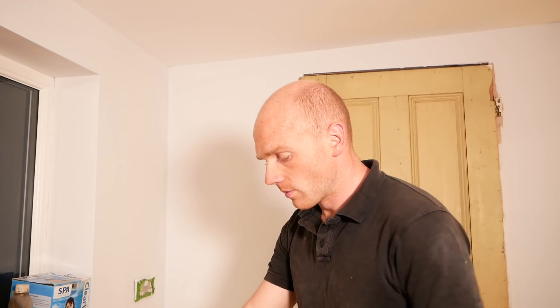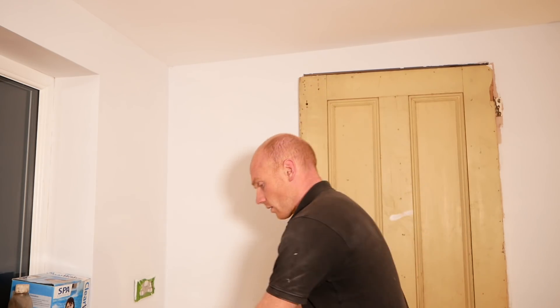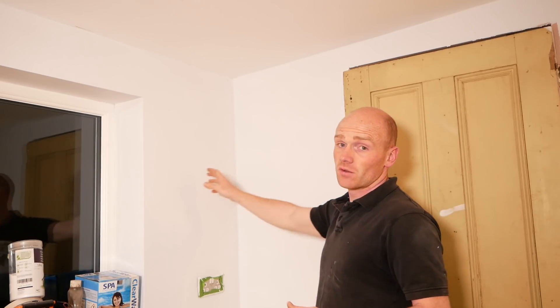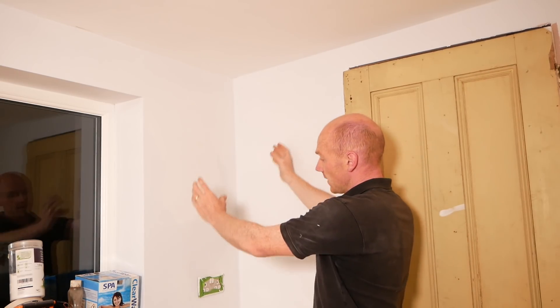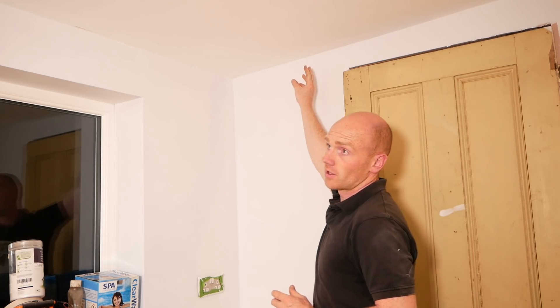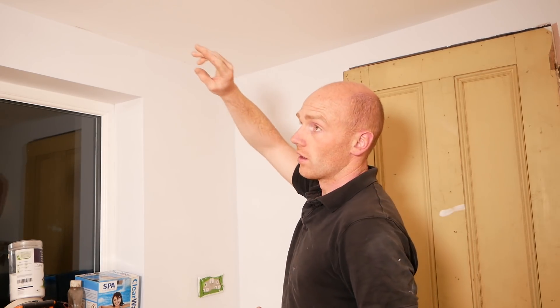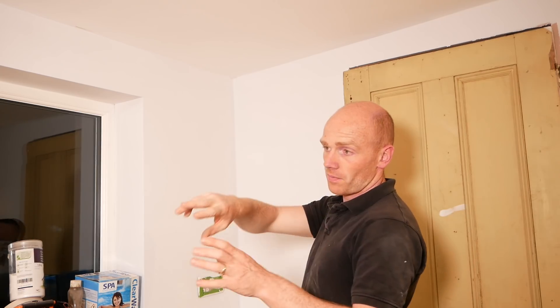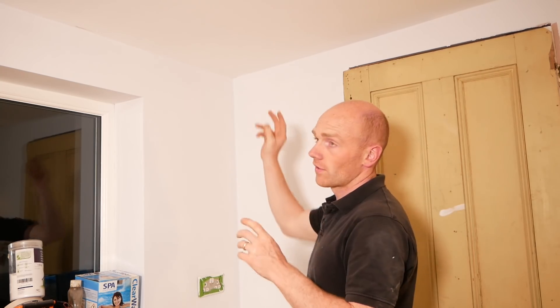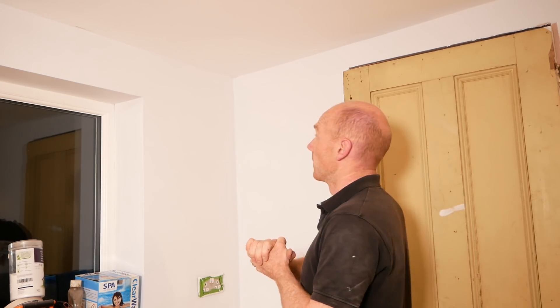First up is just a case of all the measuring out and levelling. I've got a nice flat ceiling, so I'm going to do identical to what I've just done on the other side. Originally I was planning to have the cabinets a little bit lower on the wall so I could carry a pelmet-like corner section across the front of both. Unfortunately where I put the extractor fan on that side it's a little bit high, so I had to stay above that — we'll have to go a little bit bespoke on what we do up there.